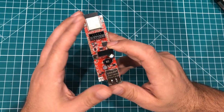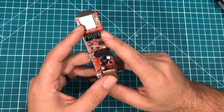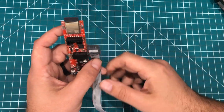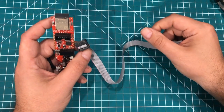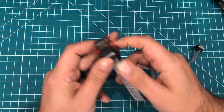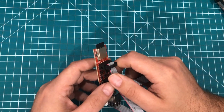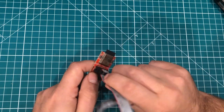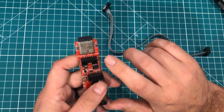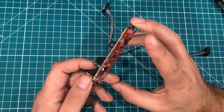This has the ESP32, which is way faster than an Arduino. It also has what they call the UEXT port. I've got a UEXT cable here — just a standard straight-through 10-pin ribbon cable. The idea is that you can access some of the most important pins through something like this. You can put your connectors into your box and disconnect this board without doing a whole bunch of DuPont wires. You get access to 3.3 volts, ground, I2C, and some of the GPIOs from there.